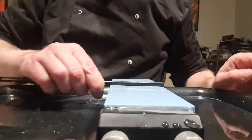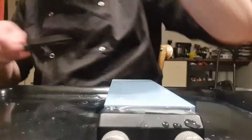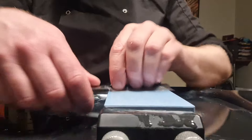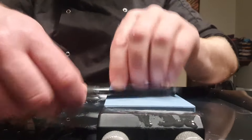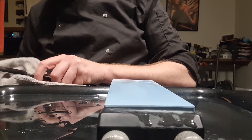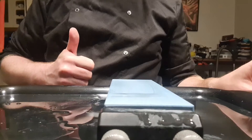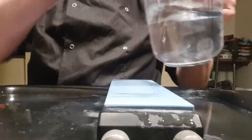I'll spend a little extra time on the tip because there is a dent just at the tip. I'll have to raise the blade slightly to work on the tip — just two or three laps to remove this dent. Let's dry the blade and have a look under the microscope. Now it starts to look much better. That's a good looking edge — the tip is perfect.